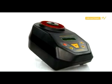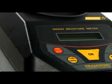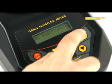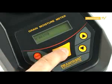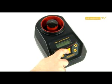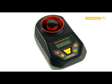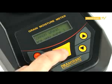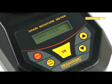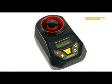In addition to the modifying function, the GMM also has an erasing mode which restores the factory settings for the chosen sample name. To use this mode, turn on the power supply with the ON-OFF button while the cancel button is pressed. Use the arrow button to choose the erasing function and confirm it by pressing OK. Choose the desired sample name with the arrow buttons and confirm with OK. A question asking whether you are confident of your choice will appear. To confirm the erasing process, press OK, or interrupt the operation by pressing the cancel button. After a successful erasing process, 'OK' will appear on the display and the star symbol will disappear. To leave the erase mode, switch off the power supply.